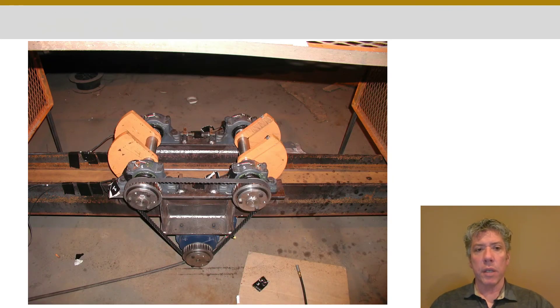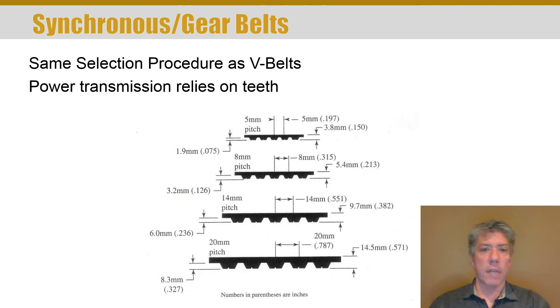Here's an example of synchronous belts being used, again from Professor Dew's experience with shaking-type machines. You can see the offset weights and the synchronous belts keeping two weights in time. There are jack screws — small screws turned with a wrench — to locate and tension the pulleys. Because synchronous belts have teeth, they don't rely on friction like other belt types; they're usually designed in a similar procedure to V-belts, but power transmission relies on tooth engagement. Adequate tension must keep the teeth engaged, and speed must be low enough that the belt doesn't ride out of the pulley. These belts are low-profile, so they can bend around relatively tight radii without excessive stress.